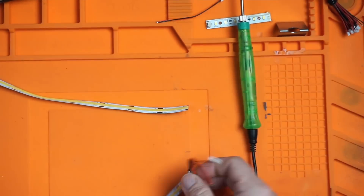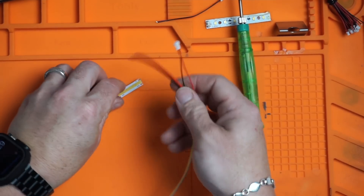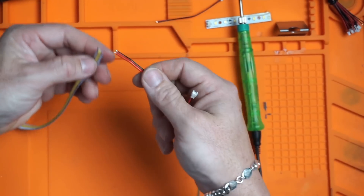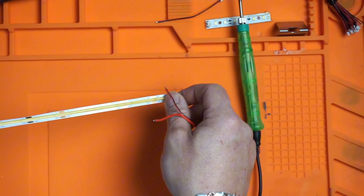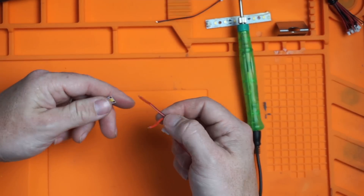Something important to keep in mind: if you buy the Cob LEDs or whatever LED lights you get, they need to be 24-volt because that's what the Creality K1 series machines run. If you don't get the ones in the description, make sure you get 24-volt. Now that we have that done, we simply need to connect the jumper over to the second strip and then we're pretty much done, other than putting the heat shrink on.